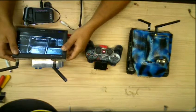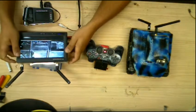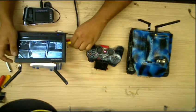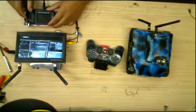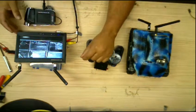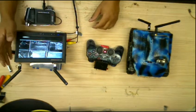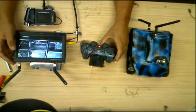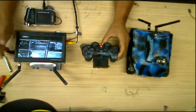As far as my video setup, I'm running dual diversity with two receivers from Range Video, mounted to the back of this display. I had to close it up with the three-cell LiPo. Using 5.8 gigahertz on the transmitter and receiver module for video, and of course my 2.4 gigahertz XP on the remote, you can get from one side of the space to the other with little to no dropout. This is my universal remote — you'll see it control other things as I progress.